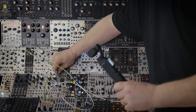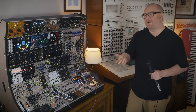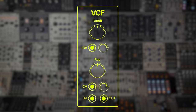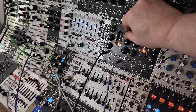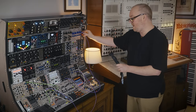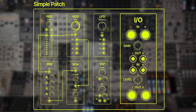What about if we use a different style of waveform? Not a particularly attractive sounding waveform, but the fundamentals of subtractive synthesis is starting with a complex wave and then manipulating it. The most common way of subtractive synthesis is with filters — voltage controlled filters. We have a standard cutoff frequency and resonance control, which as with all the other voltage controlled modules can be controlled and attenuated. The signal goes in, gets filtered, and is patched out here. After our amplifier we're going to go into a filter and then out again. And the clue is in the title — voltage controlled filter. That wiggling I was doing, we can control with anything, but it would be fun to do it with the LFO.